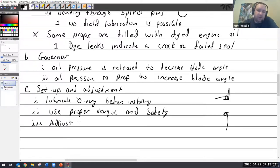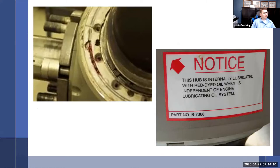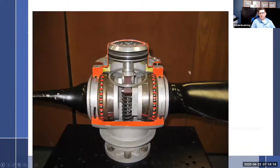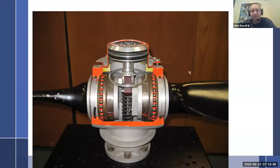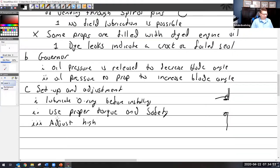Kevin? Yeah? I thought you couldn't use self-locking nuts on a part that rotated. Okay, love that. Subject to rotation, which means that the part... that's such a hard one to actually explain. Let me see, where am I? Okay, we'll go with this one. What that means is this piece right here is rotating relative to this piece right here. If the nuts are all going around, but the thing they're touching doesn't rotate under them, then you're fine. But if you've got something that's twisting and the nut here, you can't have it like that, because that's what it means by subject to rotation. It can grab the nut and start spinning the nut. Okay, that makes more sense. But if it's locked and going around like this, that's not subject to rotation. Yeah, if they're in unison, then it doesn't matter. Yeah, there you go, unison. I've never been able to really explain that one well.